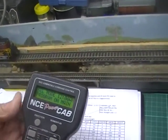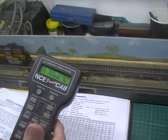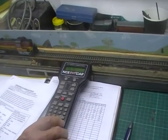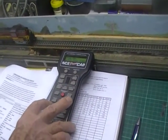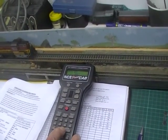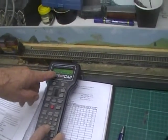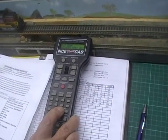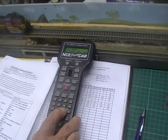Select on the main. No, we don't want that. We want to go to the fourth menu, press 4, use the programming track, and then we want to look at setting it up. Use 1 for standard, and we wait. It tells us it's manufacturer 141, which is a Throttle Up. It tells us 082, which is 8.2, the version number of that Throttle Up decoder.